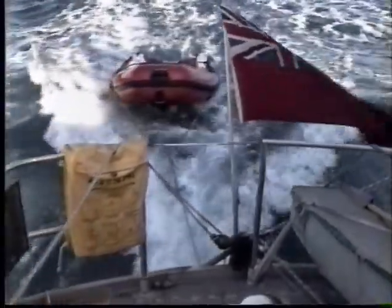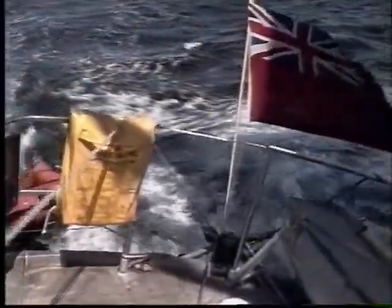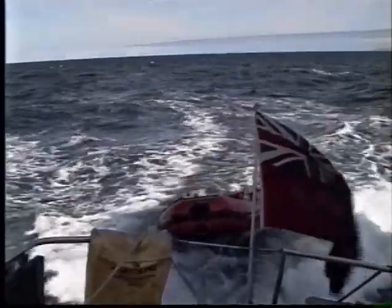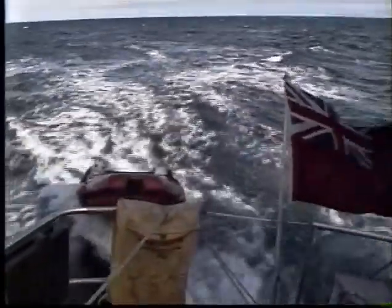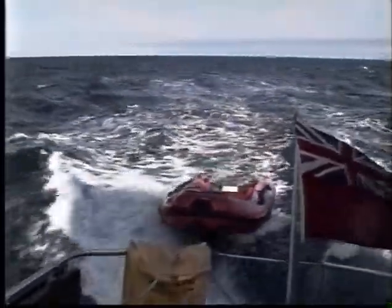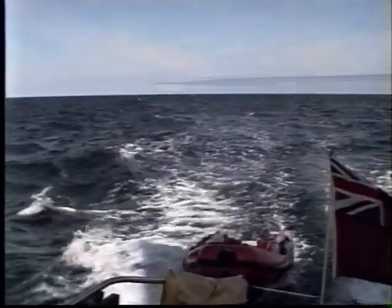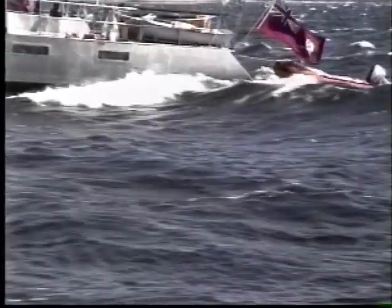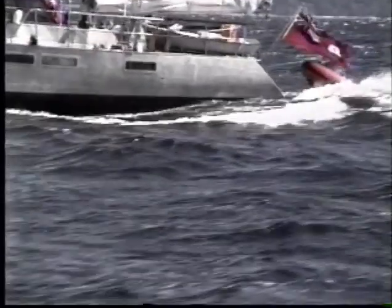We should probably make a few comments about towing dinghies. As you can see, we do tow ours on the occasional short hop if we feel the weather is settled. Of course, you have to be prepared to cut it away if it gets into trouble. When we're sailing downwind at 10 knots or more, it's towed about 20 feet astern. And when we're heading uphill, the painter's pulled up short, so the dinghy rides in seas which have been smoothed by Sundeer.